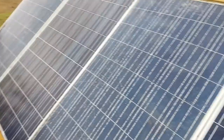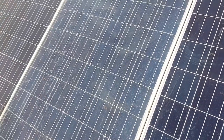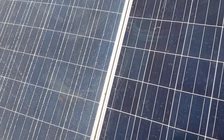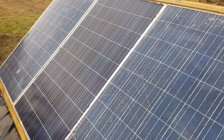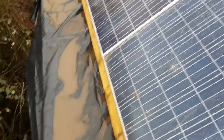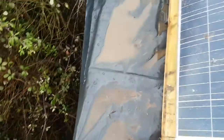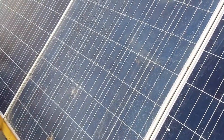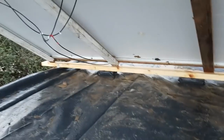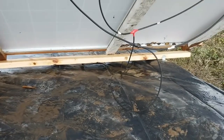I've got all the solar panels in now. I'm going to be hooking them up in parallel, all of them. But I'm running two strings, because I've got some real good cables and I've got lots of it, so it doesn't really matter about wasting some. Basically putting one good one with one bad one. Hopefully it should maintain decent voltage and then run the cables back down here inside. This is the back of the solar panels — as you can see, everything's wired in parallel. Then I'll wire these two strings in parallel into the charge controller.